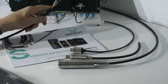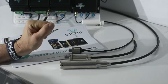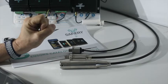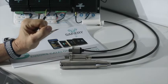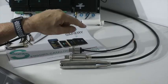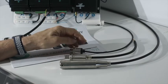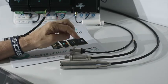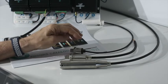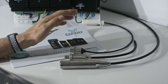All three sensors run on 12 to 24 volts and output a 0 to 5 volt signal to three decimal places — that's how we get the accuracy from the sensor. Cable length doesn't matter; we've supplied these with up to 10 meters of cable. The voltage drop on the cable is consistent, the current draw is tiny, and when you calibrate the tank the cable length becomes part of the calibration.